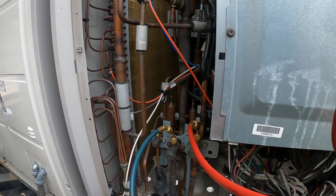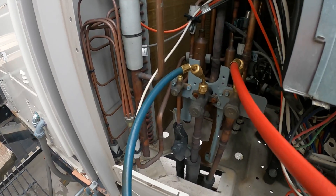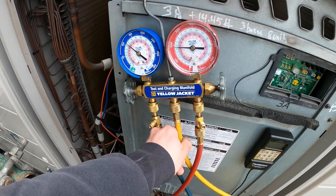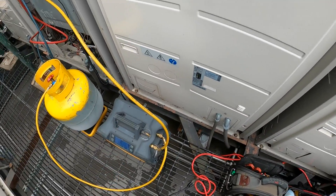If you don't have three pipes, you can still use this same process — just connect it to the two pipes that you have, low side and high side, and you're going to be alright. If we follow our middle hose, that is going to go into our recovery machine.